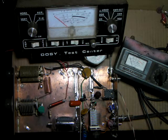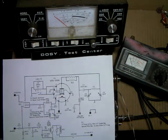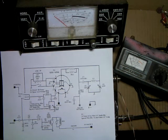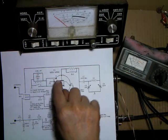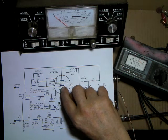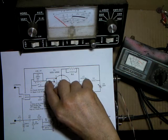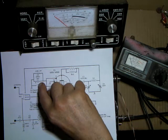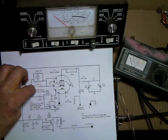This is now the complete amp as you see it. I apologize for the camera angle — I need a bigger bench to get everything in view. The high and low super mod involves removing the ground from the control grid and the screen grid, keeping them tied together but feeding them through a capacitor and a 1.5K resistor to ground.